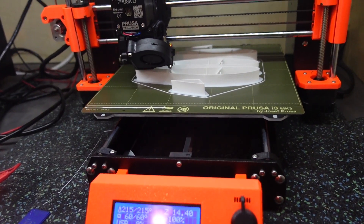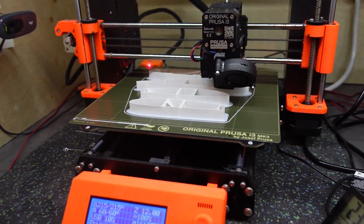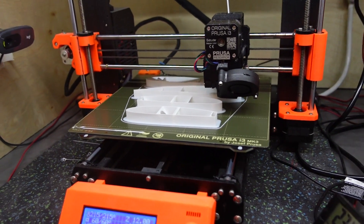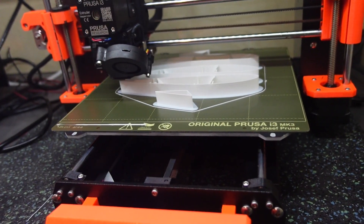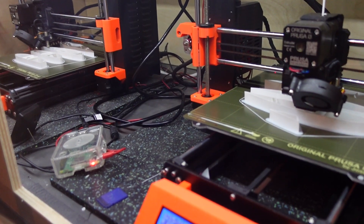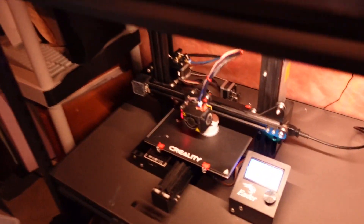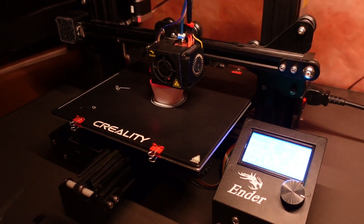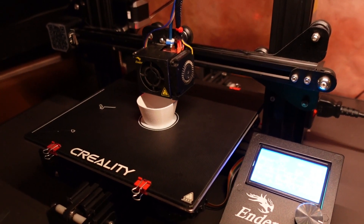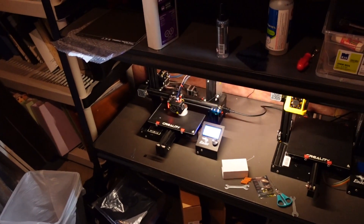In reprinting, I'm going to reprint everything in PLA. I just didn't really like how the PETG warped the wings. One thing I really like about printing in PLA versus lightweight PLA is I can print multiple sections together. I've set up two printers with pretty much the entire wing of the Eclipson Model T — they'll be ready to go tomorrow morning. And on one of my Ender 3s I've got that front part of the fuselage done, so we should have everything we need tomorrow.